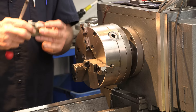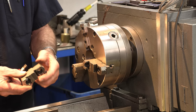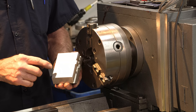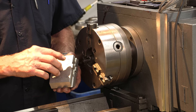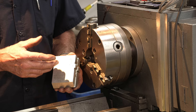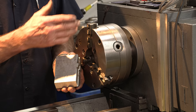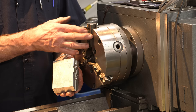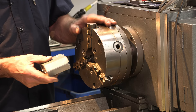This is a good time to wash out all the openings where the heads stick in and wipe the heads off, then set the jaws off to the side. Each of the jaws — in one little area right here — I've stamped one, two, three in the same location on each jaw. Your machine surfaces are always true, but sometimes if you pull the jaws off and want to put them back on, you stand a better chance of them being back in that original position and running true if you have them numbered and put them in on the same jaw — just like your upper jaw halves. You want to make sure all components for jaw one match on the scroll support and out on the jaws.